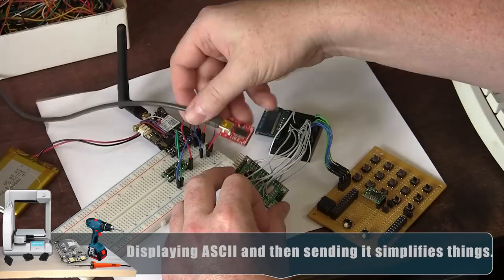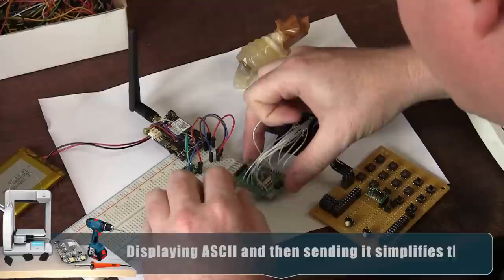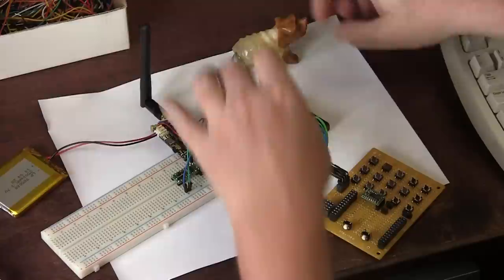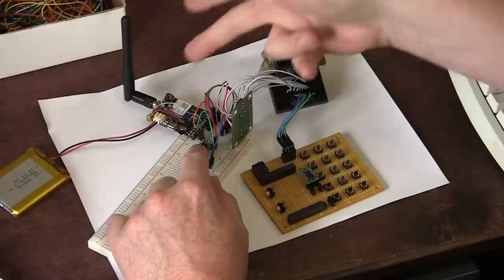I'm going to attach the AVR board to the cell phone module. We had this communication device hooked up to it before, but it's going to be talking to the module using serial. So we have ground, voltage, which is going to be 3.3 volts, and we have RX-TX. So I'm going to plug this in to line it up. See that? When I push this soft switch button, it should turn on the cell phone and the microcontroller.